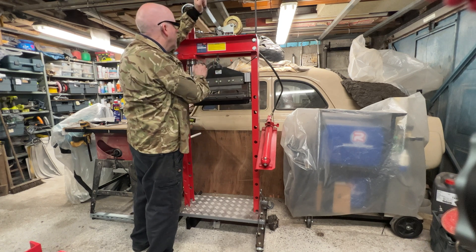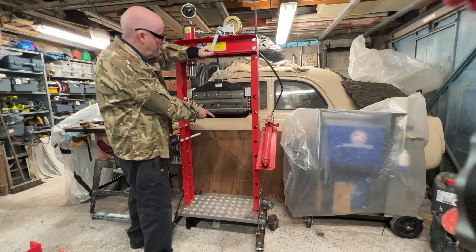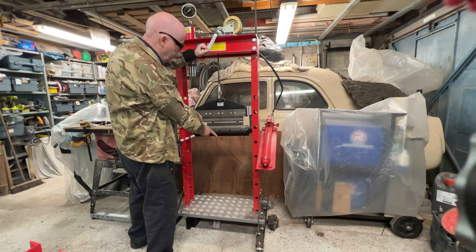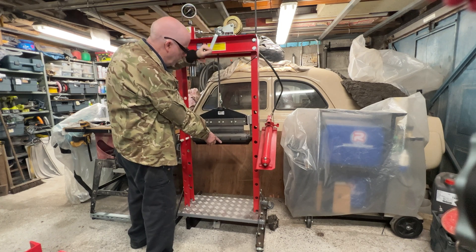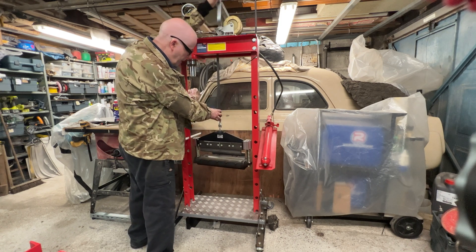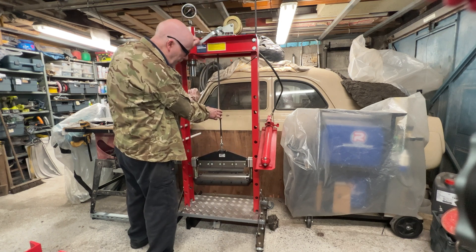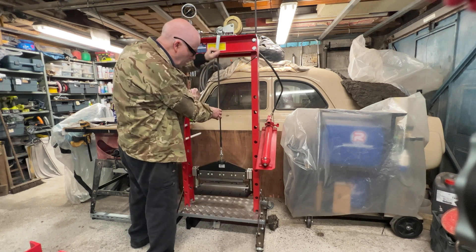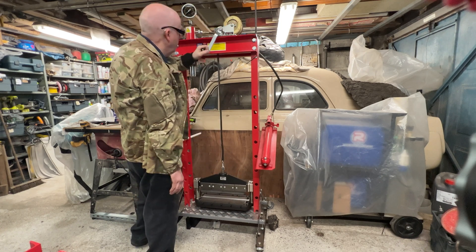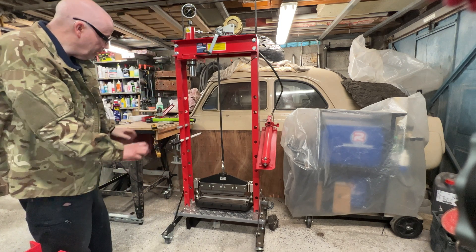Releasing the latch, and it's just slowly down. It doesn't lock — the winch doesn't lock in the downward position. So if I just let go of the handle now, it'll go 100mph through the floor. I cheaped out a bit. If you want to pay £200 you can get an automatic winch that you can wind up and leave, and it doesn't unwind — or you can unwind it, let go, and it stays where you left it. This was £30, so it only latches one way. I'm happy with that, I can live with that.